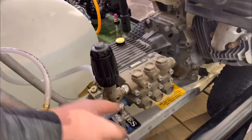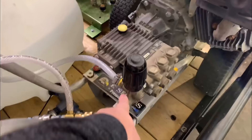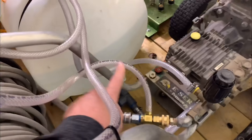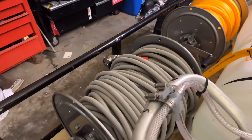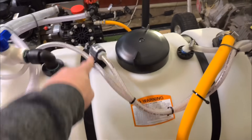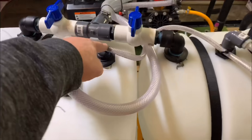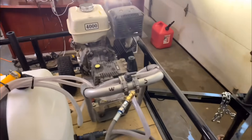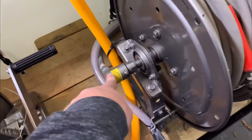From the outlet valve, it's actually going back into the tank so we don't burn up our water. From here, I gave him two new downstream injectors. From the downstream injector, I come up here to a three-way valve — this way we will make our valve last longer. I've got S for soap and W for water: one going into the water tank here through this bulkhead with a tube going all the way down to the bottom, and one for soap with a tube going all the way down to the bottom. From the downstream injector, it comes right into my swivel here for my hose reel.